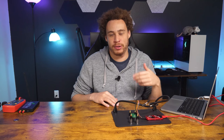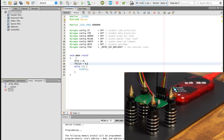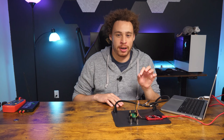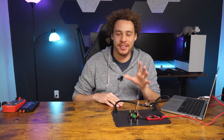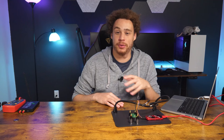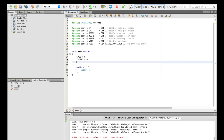A quick warning — this is an RF device so messing with the transmit pin is going to transmit a signal. That was kind of unexpected: it lit up both LEDs. I think the LEDs have been wired in backwards — rather than going from the chip pin to ground, they go from the chip pin to voltage, so when nothing is turned on there's still voltage going into the LED. To turn the LEDs off we actually have to apply a voltage so it equalizes both sides. In code this means setting the LED to 1 turns it off and setting it to 0 turns it on. The LEDs turned out to be GP4 and GP5 — and there are actually two: a green and a red.